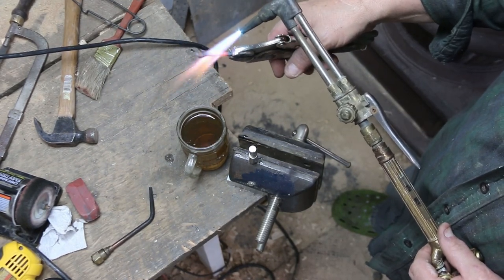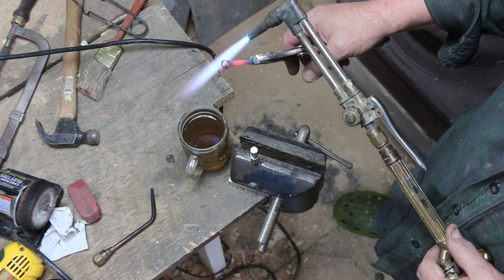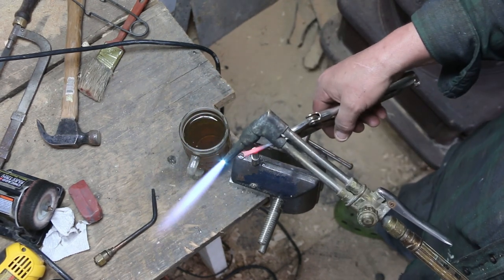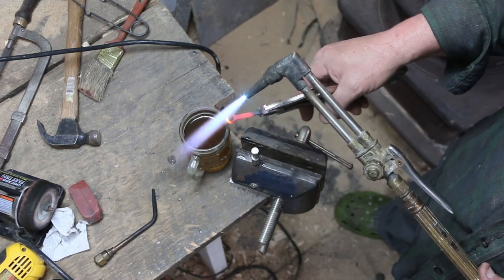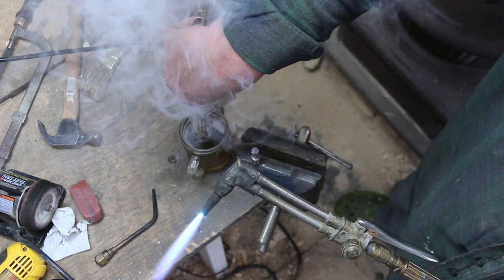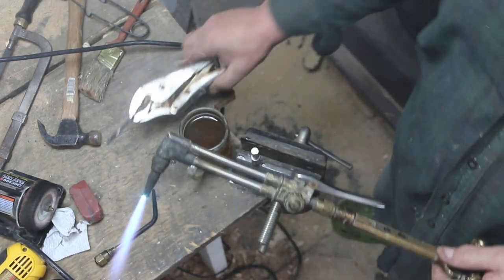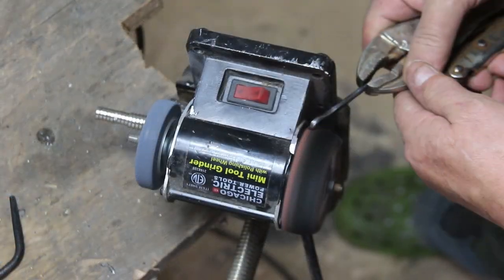Take the torch — I've got a set of magnets set up on the vise there. This is supposed to get to around 1450°F and it'll lose its magnetism. Go just a little bit further than that once it has lost its magnetism. Trying to stay away from the fine edge on the end, then into the oil as per the norm. Check it after you've hardened it — if a file skates off it, it's pretty hard. I went ahead and annealed the portion that goes into the handle, not the tip.